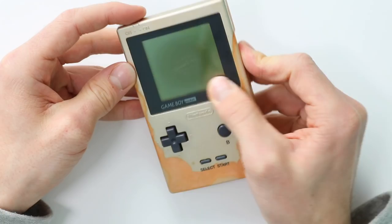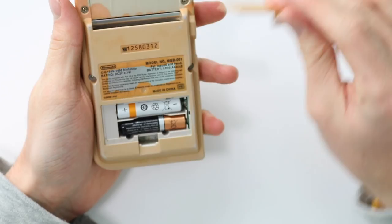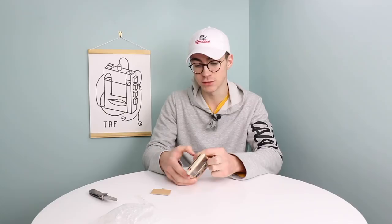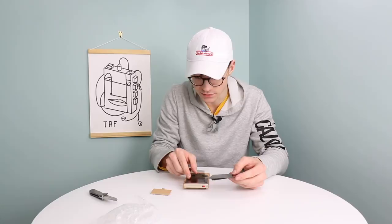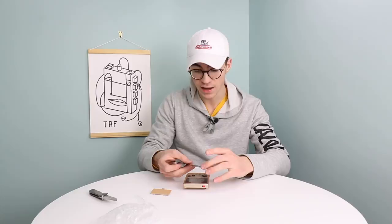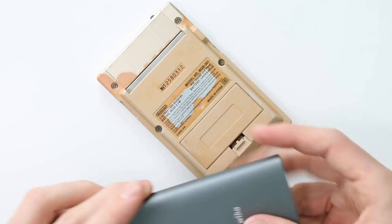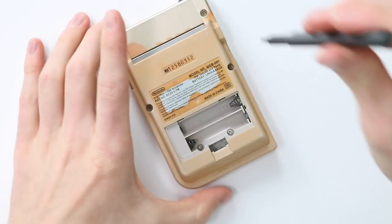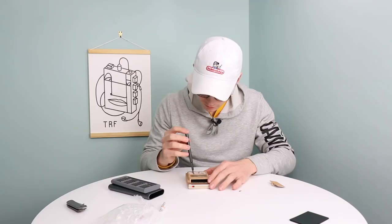We'll definitely be reusing that screen lens. What we're going to do is take this apart, fix the board, fix the screen, and then paint the shell, which I'm really excited about. I've also bulk ordered replacement polariser films - I'll leave a link in the description below. I paid about £4 for 10, and 10 will do 10 screens. Unfortunately it's not quite long enough to do double. So without a doubt, the first thing to do is take it apart - just a tri-wing screwdriver and six screws around the outside of the Game Boy shell.